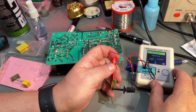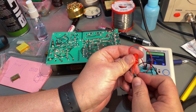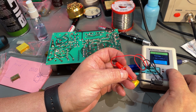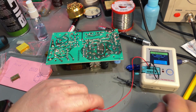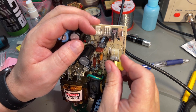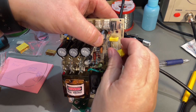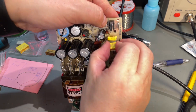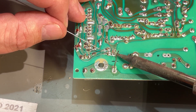It reads 12 nanofarad. Then checking the two new ones in parallel — 10 nanofarad. That's close enough, we're good to go. These as well have two different hole spacings, so I can put one there and the other in the wider position. It's not going to be pretty but it works. Then just some solder and we've made ourselves the required X2 capacitor value.